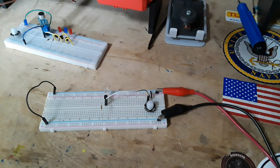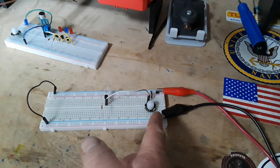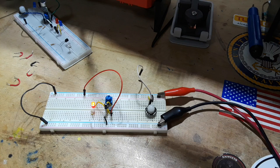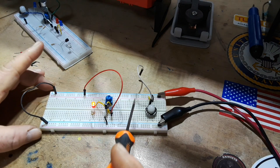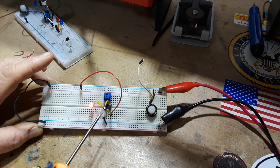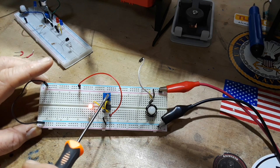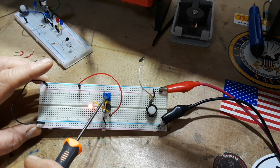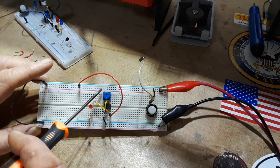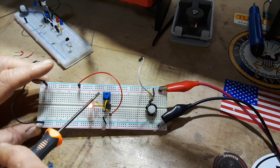So that is about the simplest method I can think of. Let's go for a method that's just slightly more difficult. Instead of this transistor, we'll use the output of that sensor to trigger a 555 timer. Here is method number two. This time we are using a 555 timer set up in what I call my quickest or simplest way, which means we're using a trimmer in place of our two resistors, and there is a link coming from VCC to pin 8, which is the power input to the 555 timer.